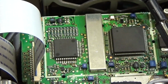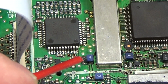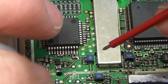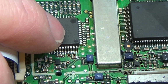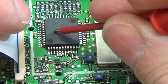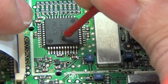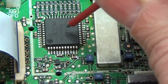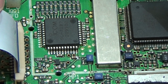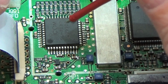So what we definitely know is that this little coil is dead, so it is open, and if I go now behind our coil, then I'm feeding the IC, okay, and I've set the voltage to 4 volt, and we know that normally it is a 5 volt IC, and if I put 4 volt to this point, nothing should happen to the IC, and therefore if it is fine I can't destroy it, but if it is bad we will definitely see a huge power which gets drawn, and then we should easily be able to identify what's really going on.